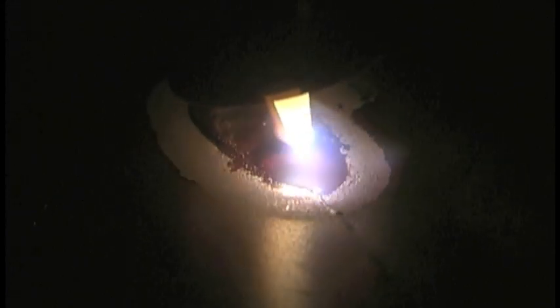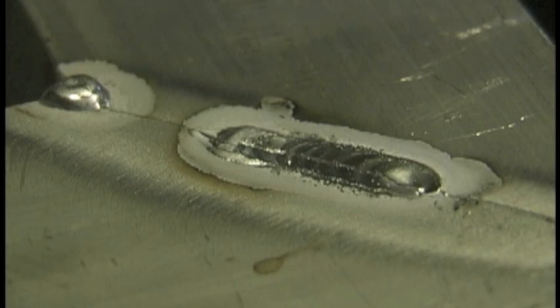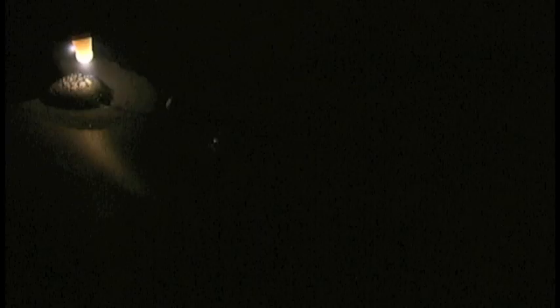This is a good example right here — I'm putting a fusion tack on here with no filler metal, and you don't want to do that on aluminum. It's going to crack almost nine times out of ten. See the crack right down the middle there? Aluminum is weak as water when it's hot — it's a condition called hot shortness. Aluminum is hot short and it cracks under certain ranges of heat. Welding from an edge is generally not a good idea on aluminum; you can wind up with cracks if you're not careful.